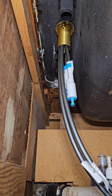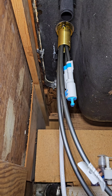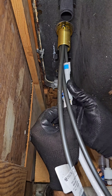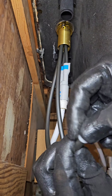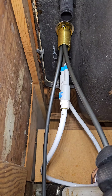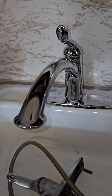Tying up the sprayer adapter, again using the red tool for the plastic nuts. Compression fitting for the sprayer — pop it in, nice quick connect. Cutting in the water supply lines — you can tell the hot and cold by the red and blue. If you're colorblind you gotta read the label; it's usually marked on the hot side. And boom, it's all done.